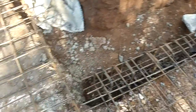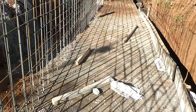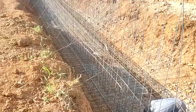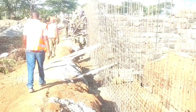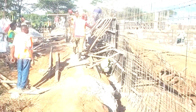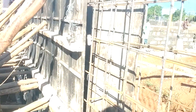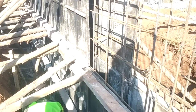The next thing you are going to do is to do the concreting of the floor of the footings. After this, I'm going to show you the formwork as we progress. What you are seeing here is formwork which is ongoing on the upper sections where we have completed our work. There's a space in between. The formwork should be reinforced well so that you have a neat job and to avoid dislocation when you are vibrating.